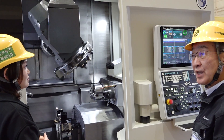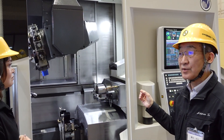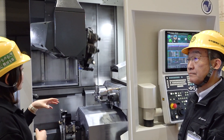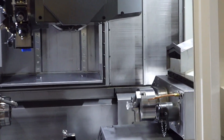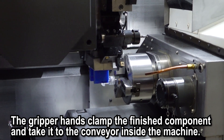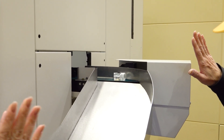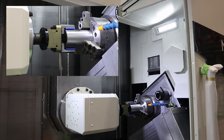The good thing is that when gripping, the load of the servo motor can be used to check the grip, and the gripper force can be commanded in the program. This prevents empty gripping and allows gently gripping thin work pieces. The gripper hands clamp the finished components and take them to the conveyor inside the machine. The same thing can be done with the tool spindle machine as well as the turret machine, and some customers use it to pick up work pieces with complex shapes.